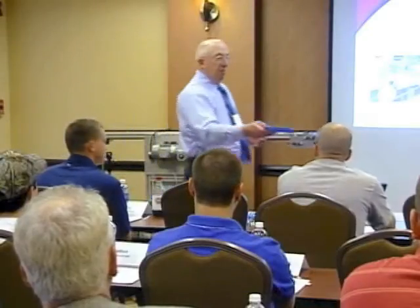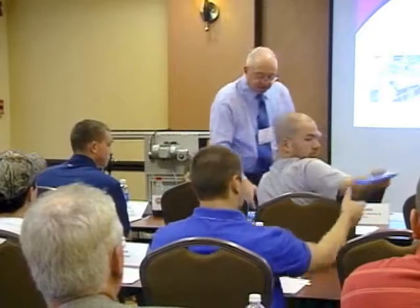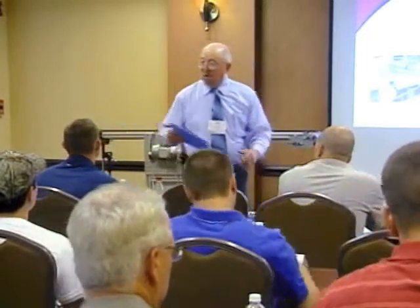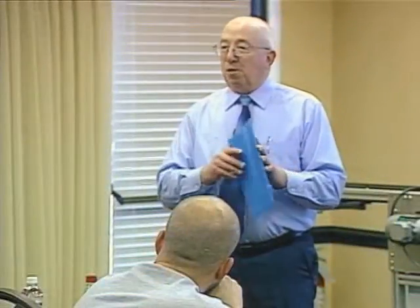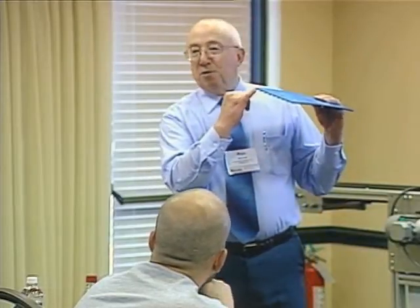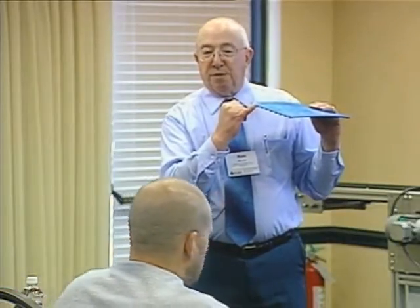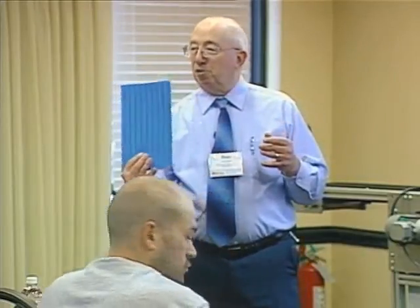I'll pass these around. There are several different manufacturers that do this, and there are several different variations. That happens to be the most common one, which is on a 2-inch pitch. Now when we talk about pitch, and we'll do the same thing on modular, you're talking about from the center of one tooth to the center of the next tooth. That's what is referred to as the pitch of the belt. This happens to be 2 inches nominal. This one is about 3/4 of an inch nominal. Runs on a drive sprocket.